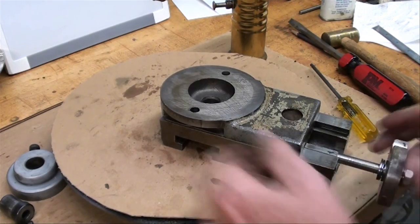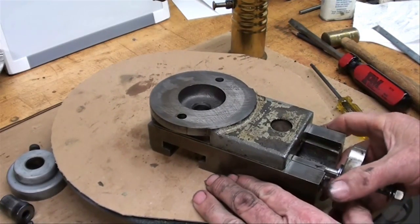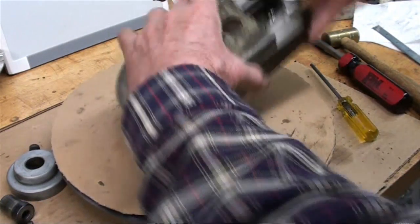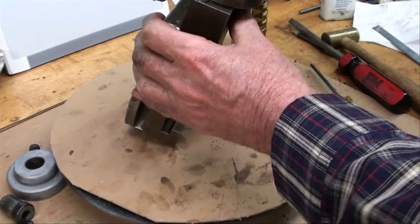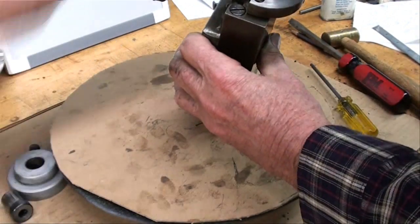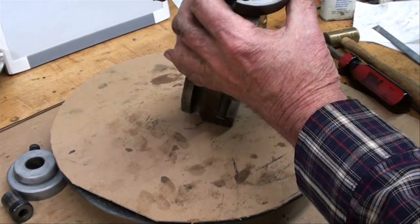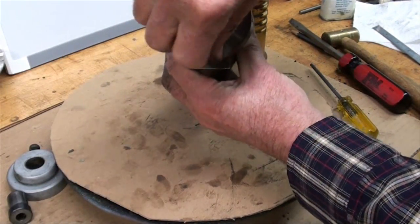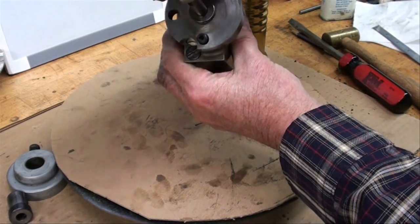Run that up a little ways and see how it turns — I haven't tightened that set screw yet, so that'll be one of the last things I do. This notch here lines up with the Gibb adjusting screw, and then I'm going to stick the two cap screws in there. Everything's clean. Put it down in there — and then these can be snugged up.